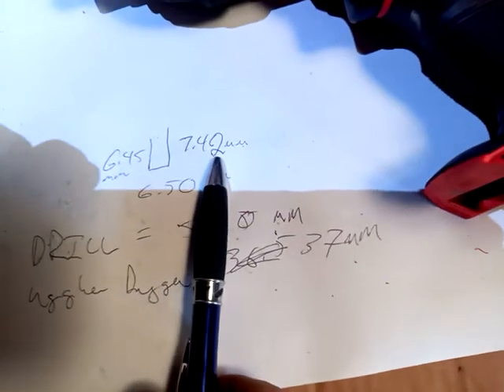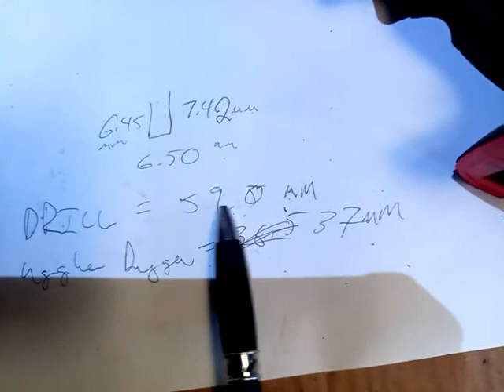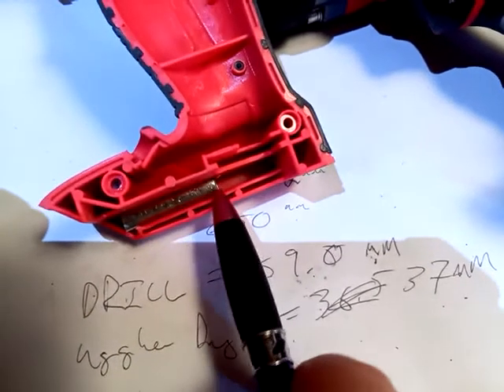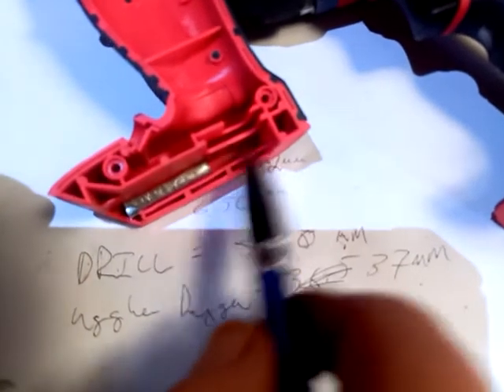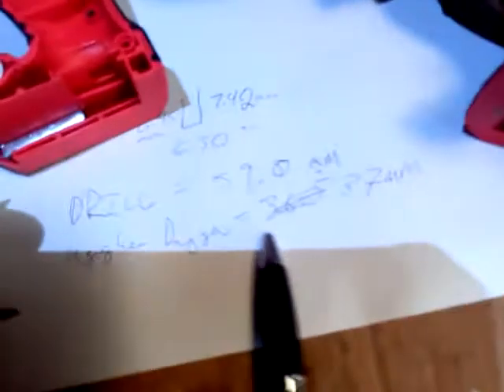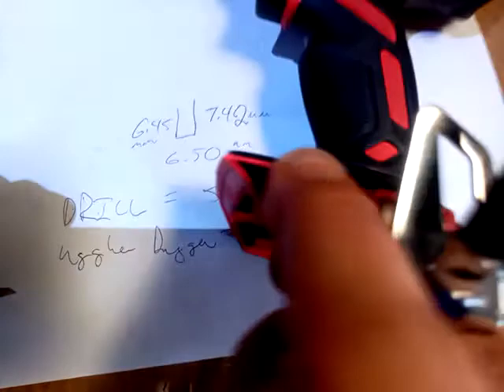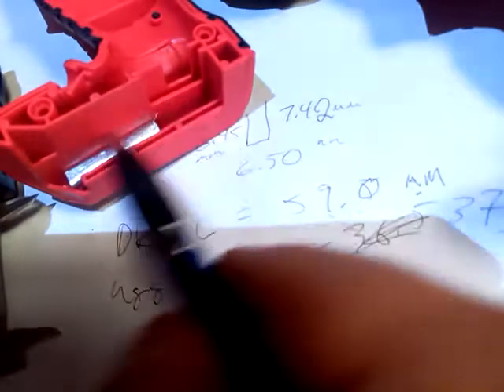The length depends on the tool. On the drill, you can make both sides 7.42 millimeters, and the total length is 59 millimeters — that's based on the measurement of the battery canal. On the UGA-DUGA gun, I made two of these and realized I only need one; one on one side is enough to stop you from accidentally inserting the battery. The piece length is 37 millimeters, because you want to stop the battery before it gets close to the contacts. Ideally, your stop piece should span the full length of the canal so it can't be forced back over time.